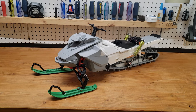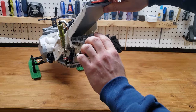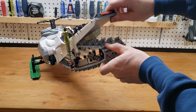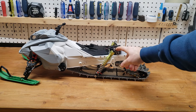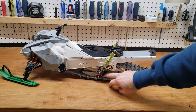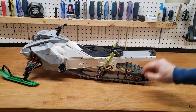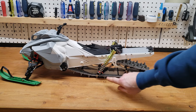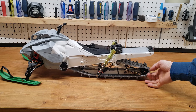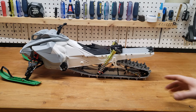As far as I can tell, I've never seen twin track with active movement. Here's how it works: in the back you've got two tracks side by side, essentially independent — they can go wherever they want, they both have their own suspension. They are connected indirectly to a servo via a third spring. One spring is for normal suspension, one controls the front of the skid, and the third one puts preload. With so much pressure at the front, the back would fly up too much, so I added preload to push the rear arm down and put more pressure at the tip.